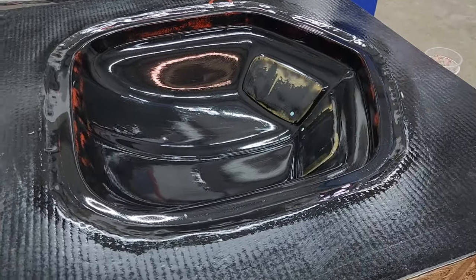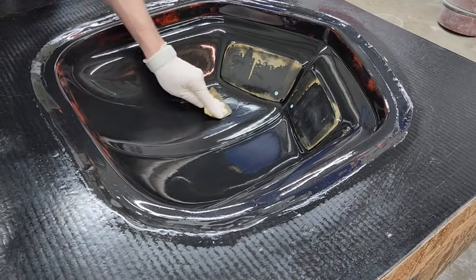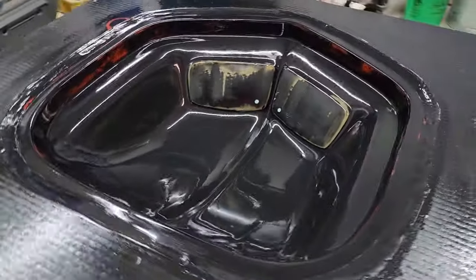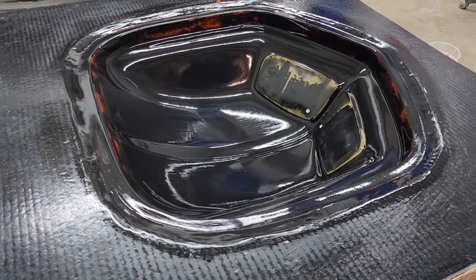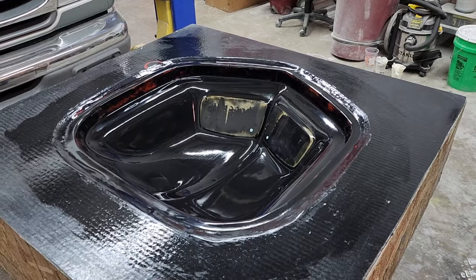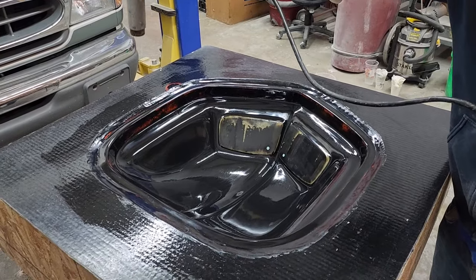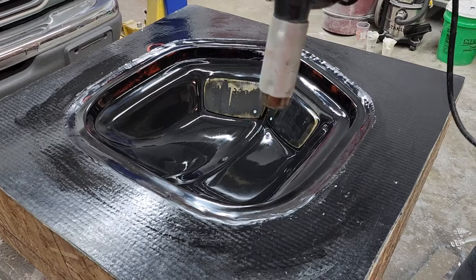Brandon has wiped the entire inside of the mold and as you can see it's got a fairly smooth thin coating — we don't want any drips. This will dry within about a minute. If it's really cold or humid you may need a hair dryer or heat gun — you don't want to get it too hot, just let it evaporate off since it's made of alcohol. We're looking for a surface finish that's evenly shiny all the way around, which is our last defense against the part sticking in the mold.